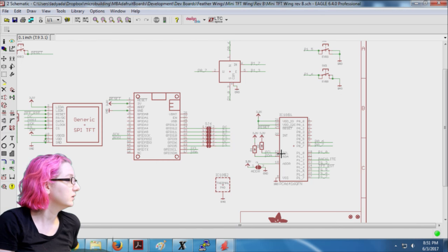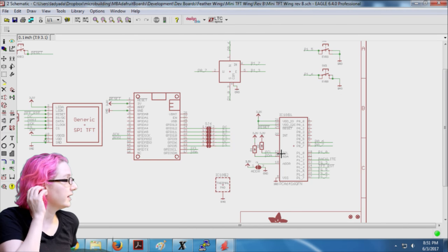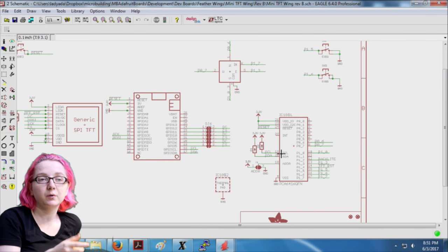I put pretty much all the GPIO I could onto the expander: buttons, backlight, and TFT reset. It has 16 GPIO; I only use nine, but that's fine. It's actually cheaper to get a 16-pin GPIO expander than an 8-bit one. It's nice that it'll handle all the button handling — on the ESP8266 there aren't enough pins for each button, so the expander takes care of it. I got prototypes and thought I'd put it together.